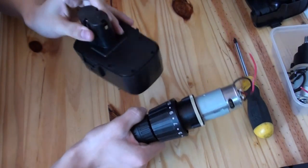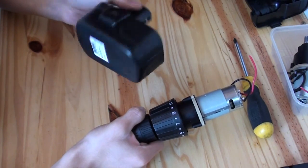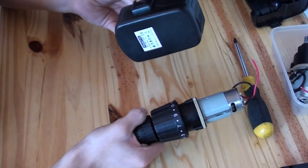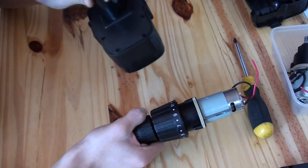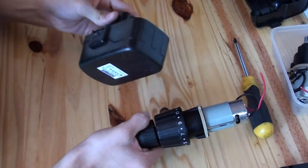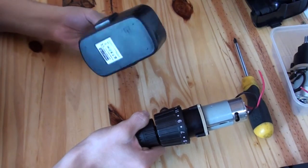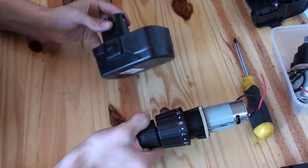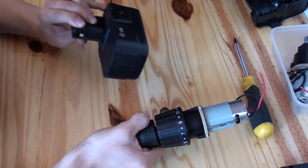Incidentally, the batteries in these things are cheap NiCad cells, normally ranging from 1 to 1.3 amp hours. They're all right, but I find they struggle on how much power they can put out. Those can be used, but you might be better off looking into some cheap NiMHs from somewhere like Component Shop, or getting some lithium polymer batteries for no weight at all and incredible power.